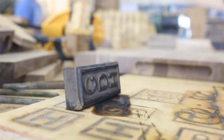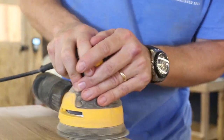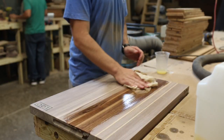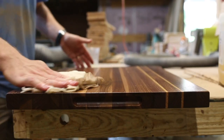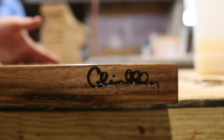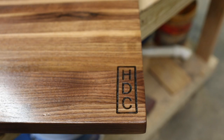A little branding here — personalizing the board is one of my favorite parts. Once it's sanded and the oil is wiped on, those brands really come alive. Right here I'm doing the sanding: we start with 120 grit and usually end with 220 grit on our boards. Then we apply the oil — it's so therapeutic; it just takes that dry wood and brings all the life out. As you can see, the brands just pop once you get that oil in there. And that's it — that's how we make a cutting board right here at Harp Design Co. Please subscribe to our YouTube channel and we'll keep posting more. Thanks so much!